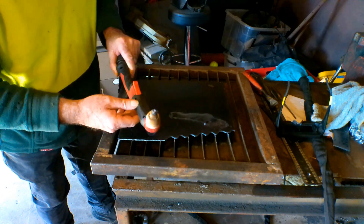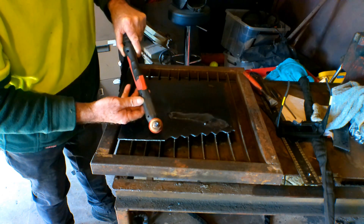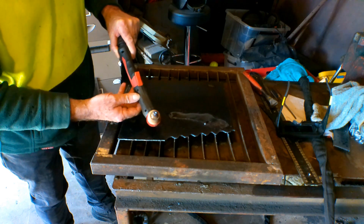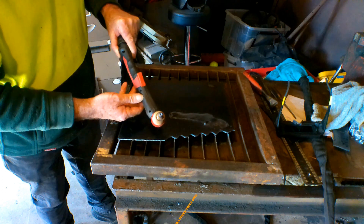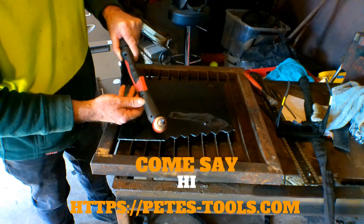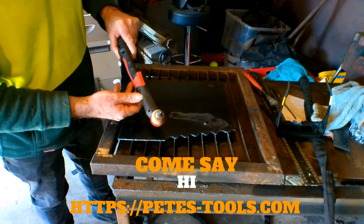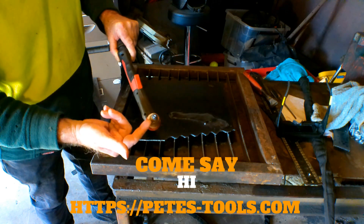It's totally horrible. Look what it's done to the nozzle guys, check that out. Look what it's done to the nozzle. It's absolutely terrible guys. So yeah, I would not advise you to have no air pressure or low air pressure when you're plasma cutting guys, because it really doesn't do much for your machine. It does nothing for your nozzles. That one is absolutely shot now.